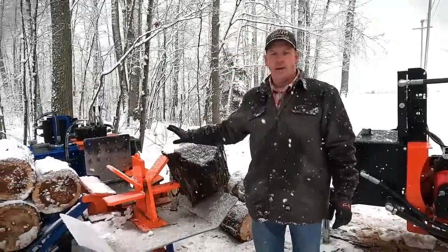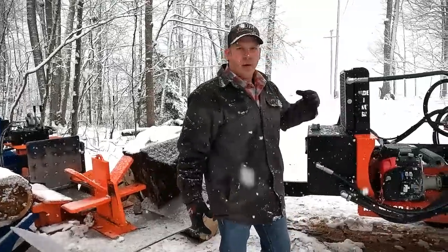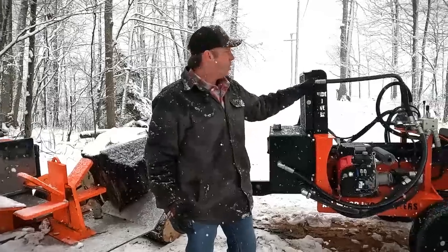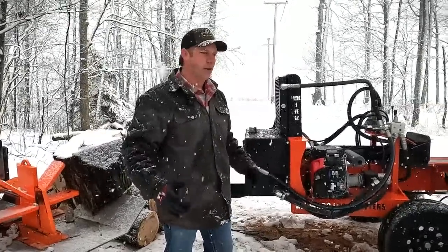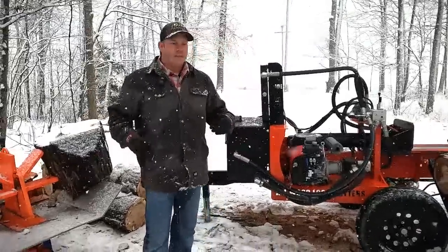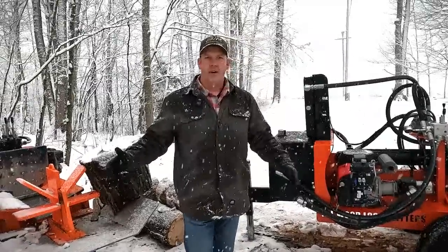So one more difference. The Eastonmade 1222 has full autocycle on it. So you hit both levers down and back. The All Wood Musclewood that we have comes with full auto cycle, but we ordered it special with just an auto down, and then you have to reverse the lever to auto back because we thought that would be safer when our kids are running this machine. So that's gonna be advantage Eastonmade. It'll show how important that auto cycle can be when you're working by yourself.